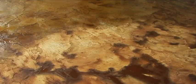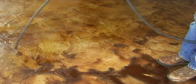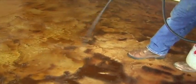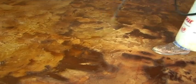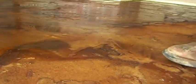For applications including DCI lithium hardener sealer, consider repeating this step to be absolutely certain the surface has been properly neutralized before proceeding. Clean the surface carefully until all debris and excess stain are removed from the floor and the rinse water is completely free of color. This may take several washes.